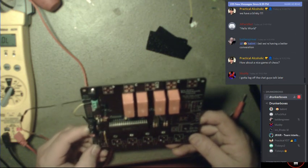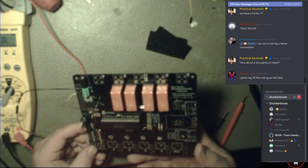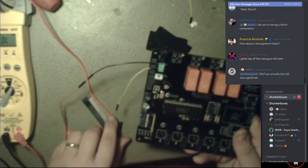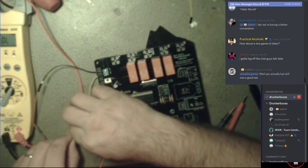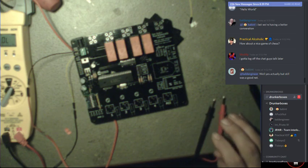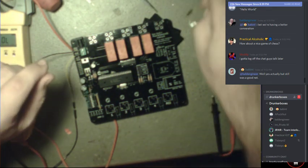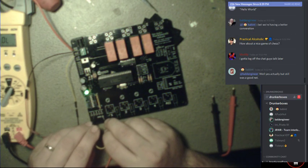And they have these programming wheels. These programming wheels are wheels that have conductors on them. They're mostly spring-loaded, at least the later ones were, so you could reset them to 0. But every time you did an action on the board, it would move the wheel forward. And that's how it saved its current logical state, and it would connect different connectors together. So it kind of works like a music box.